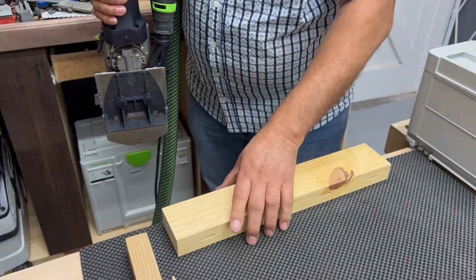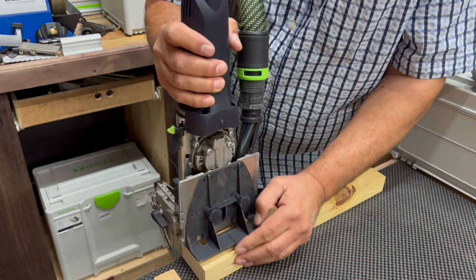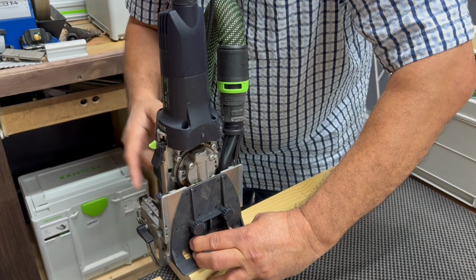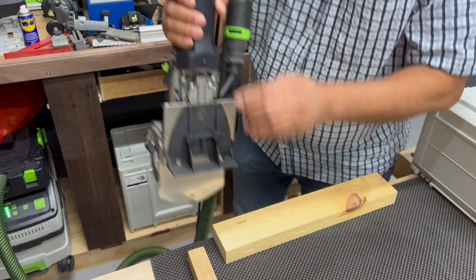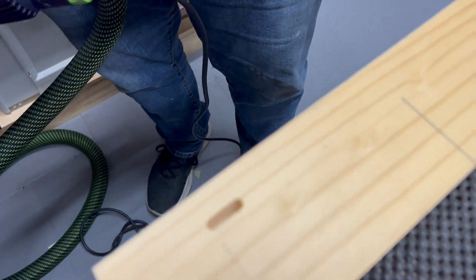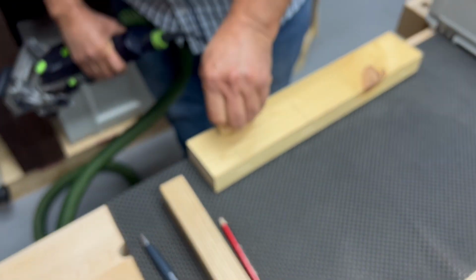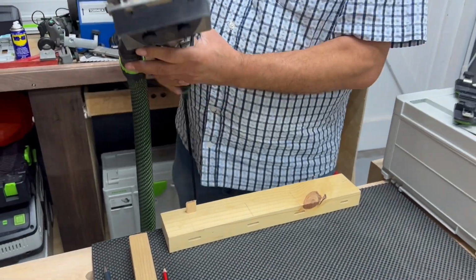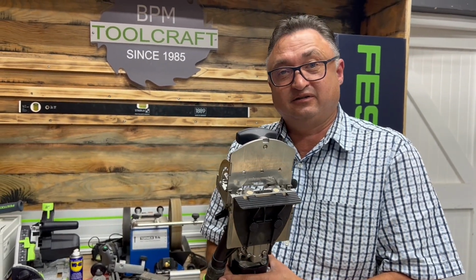we haven't done any measurement over here. So obviously you'll have to do the measurement to make sure that it's sort of center. That actually goes on here. You hold that in place, switch the machine on. That's the hole over there. And obviously now the domino will fit in there. Again, that hole could be wider if you want it to be, but that's where your domino will now fit in. Okay, and those are the features that you actually get with your Festool Domino Machine DF500.